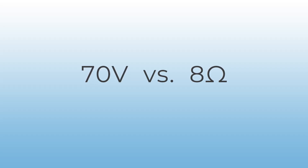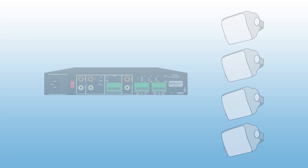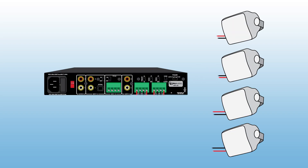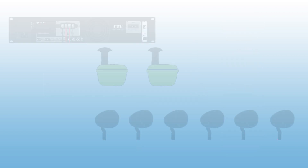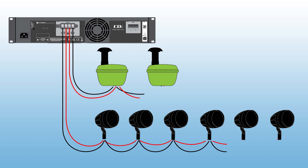In commercial applications it is far more common to run speakers in 70 volt rather than 8 ohm. The 8 ohm architecture requires a speaker cable home-run to the amplifier for each speaker. Whereas 70 volt allows you to daisy chain each speaker together, tying the positive conductors together and the negative conductors together, accomplished by using a transformer with each speaker that converts the carry voltage into an 8 ohm signal. In addition to being easier to wire, 70 volt allows speaker cables to run over far greater distances without notable volume loss, whereas 8 ohm can only run a couple hundred feet before significant drops in volume.